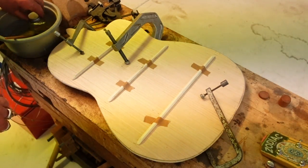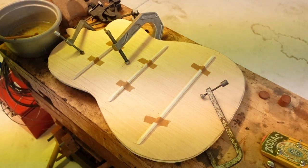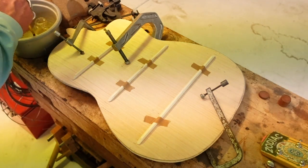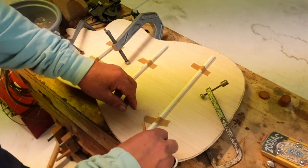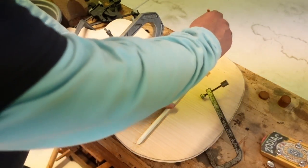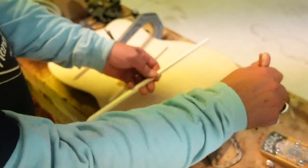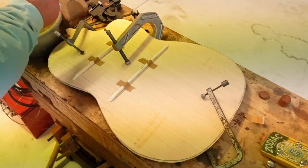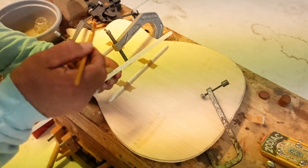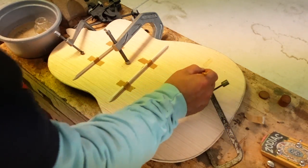Okay, guys, I think we're getting towards the end of this episode. We are going to burn our fingers on this hide glue that I've got heated up here. And we are going to put these braces on. And I've got some clamps put together, and I'll just make a couple marks with the wet brush there. And line everything up. There we go. And put some ample supply of hide glue there and give ourselves a streak there like so.